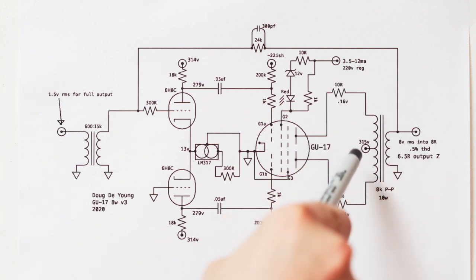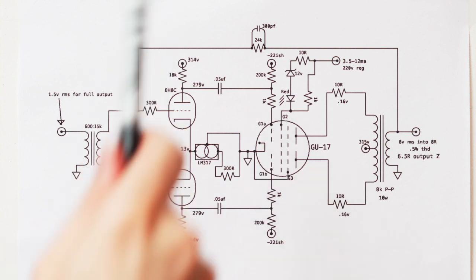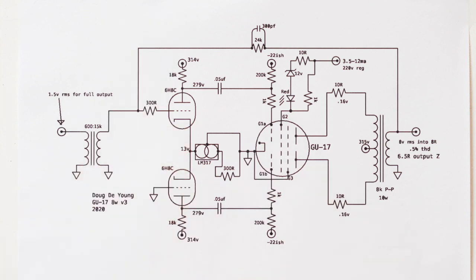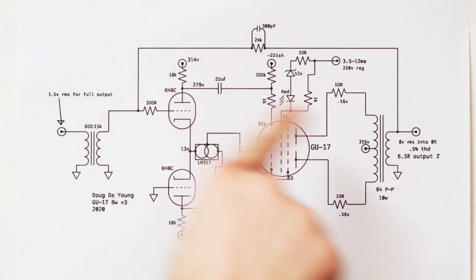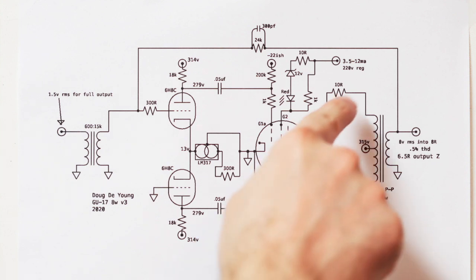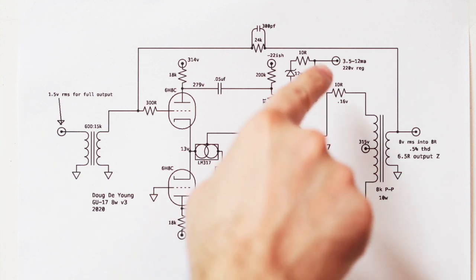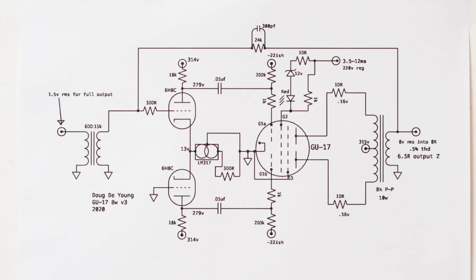And then I just got my output tube set up, and I got my power tube set up, and I just applied an arbitrary negative voltage to the grids and started cranking up my high voltage until I reached a point where the tube was operating at a normal operating point. That ended up being about 16 milliamps per side with about 315 volts on the plate. I also got another supply out for my screen supply, so I ended up with 220 volts on the screen. And this was all found just empirically.